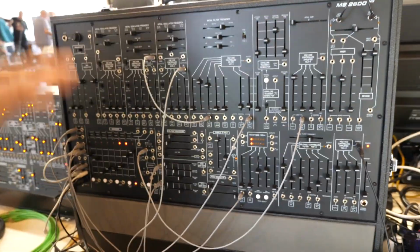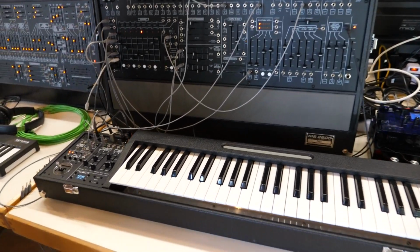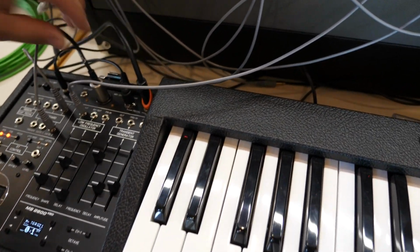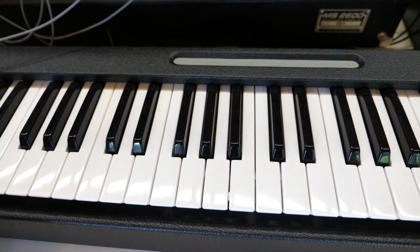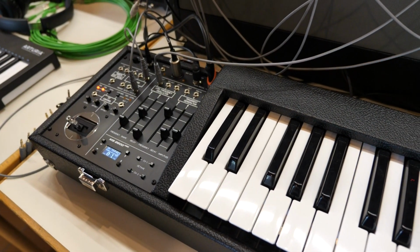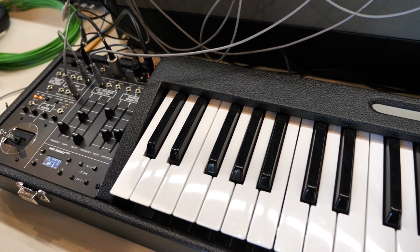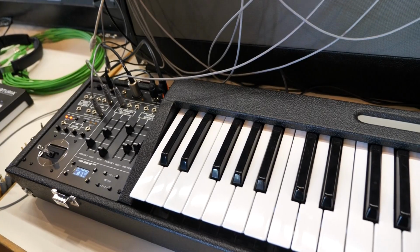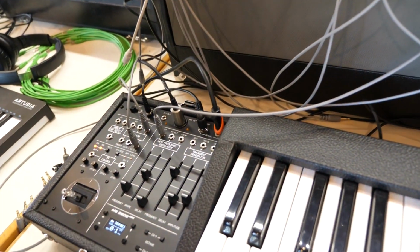As an extension for the synth, I have made a new keyboard. It's designed for analog synthesizers. Basically, the idea is to have a lot of voltage control to control your synthesizer, but it also has a MIDI implementation. We have a keyboard, a joystick, a ribbon controller, and an LFO with many waveforms and delay, and we have a transient generator to generate some special forms, like to modulate a filter like an echo, ping, ping, ping, or to make the VCO on the attack, like to make, oh!